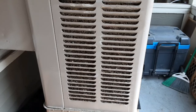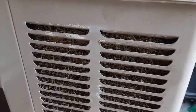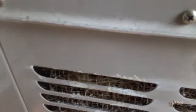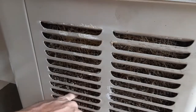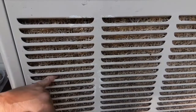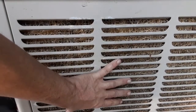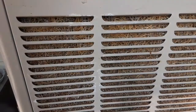First thing I'm going to do is check — after I've brushed off all the calcification from the water — I'm going to make sure that water is going down all these inside layers here. If I zoom in a little bit you can see the water running. You can stick your finger in there and just make sure all of that mat in there is wet. This setup has three sides; you can see the water running in up here. You just want to make sure those mats are all getting wet, because that's how the swamp cooler works: air comes in, gets sucked through, and as the water vaporizes it causes a temperature drop — you can get about a 20 to 25 degree temperature drop inside your home.